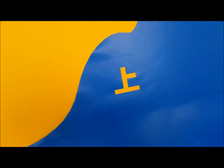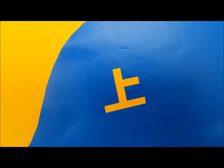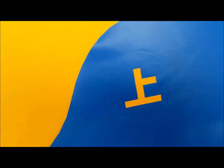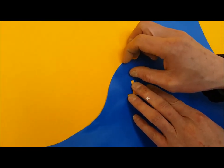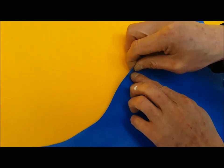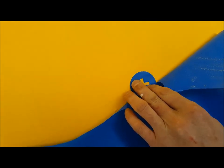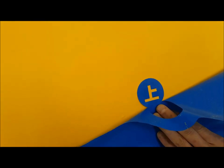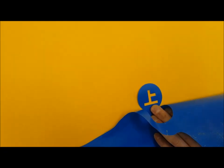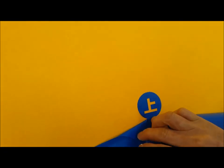Once torn off, we cannot find the position and it's hard for us to recolor, so you'll easily make mistakes while recoloring. In order to avoid this happening, when we paste it, we had better tear off the mark. When you tear off the bottom paper, the mark will be naturally left on the wall. Look carefully after you paste it, and then tear off the mark immediately. So after the construction, when we tear off the wallpaper, the mark will stay on the wall.